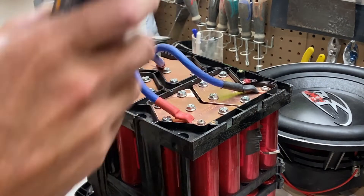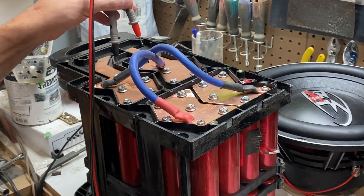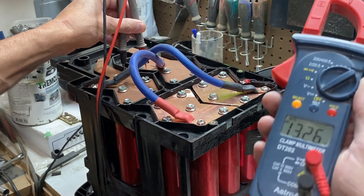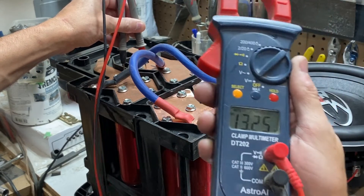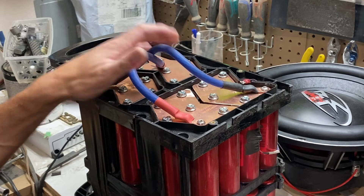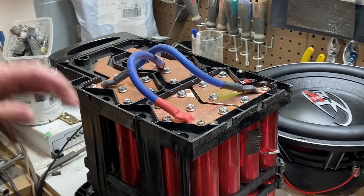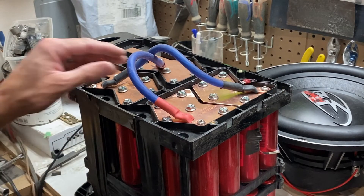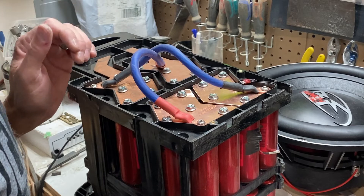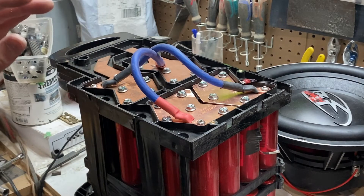What we would expect to see — and we are reading — 13.26 volts. So that's what we would expect to see. These are fully charged cells. And that is it — that is the modification to convert the entire 24 volt beast module into a 12 volt beast module. These are four gauge jumpers. I would probably use something bigger than that if I was going to actually be putting this in a car, but functionally this will work.